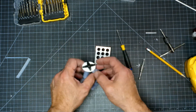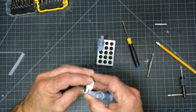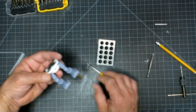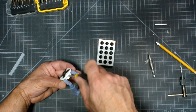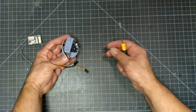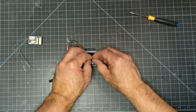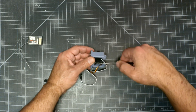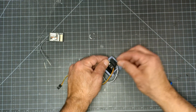Initially, the hip was separate from the lower saucer cutout. I quickly realized that I just needed to make the hip and the cutout one part. I bolted the servo horn to the cutout and left a hole from underneath so I could attach the set screw to the servo. It did require things to go together in a certain order. The servo core went through about seven iterations before I landed on the one that has two servos and the control board mounted in the middle.